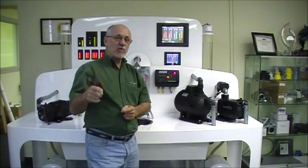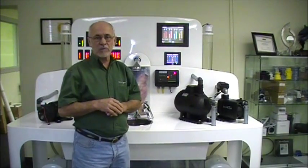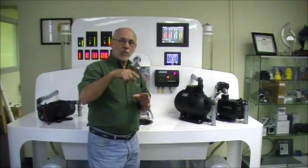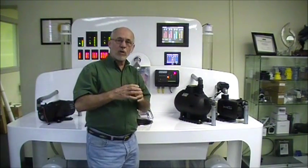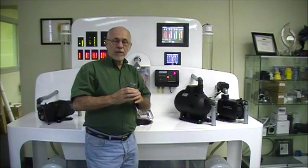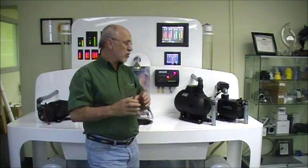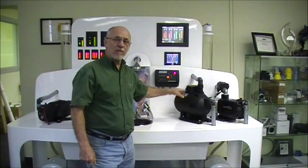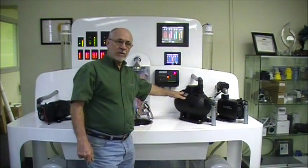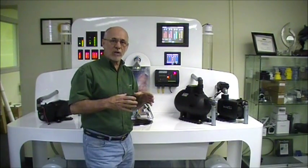After the pump is finished working — in other words, if all your faucets are closed and there's no more demand on the system — the flow meter in the pump sees no flow or no demand, and after the flow meter sees no flow for 15 seconds, it turns the pump off. If you're running out of water and it turns the pump off, that means there's no pressure and the pressure switch isn't satisfied, so it turns off and shows an alarm light — a dry run light. The flow meter and the pressure switch work together to decide if your pump is turning off normally or turning off on an alarm.